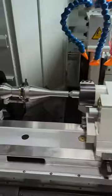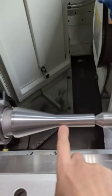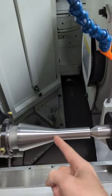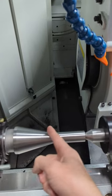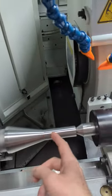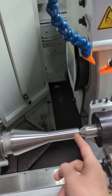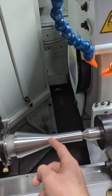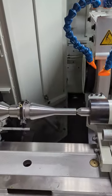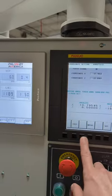If you don't have a shoulder, go to where you want your wheel to start. And I want mine to start here. Matter of fact, I came in here on the grindstock part, and after I profiled that, I touched right here, just by jogging in the hand wheel, and I made my point measured off of this end here, and so that's where I set my zero. That was the easiest thing I could think of to do at the time. And then once you get there, you'd hit set.